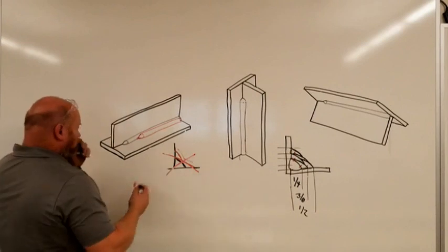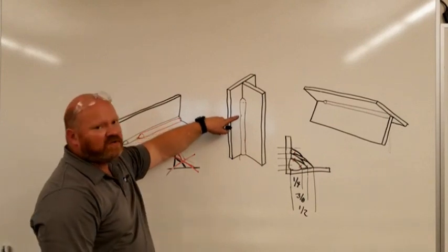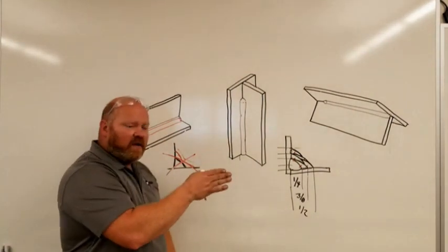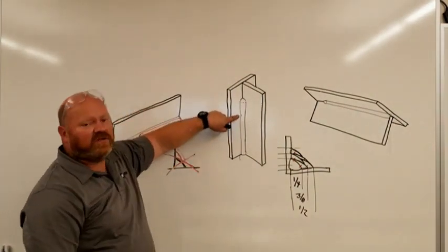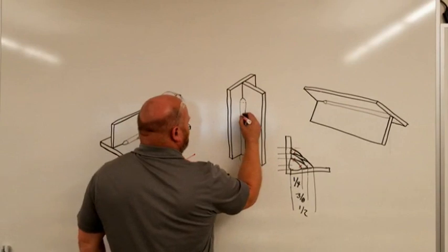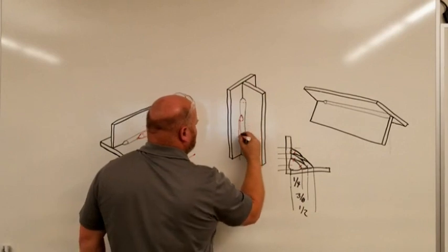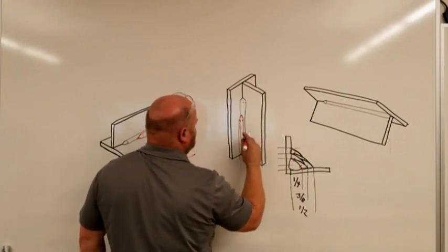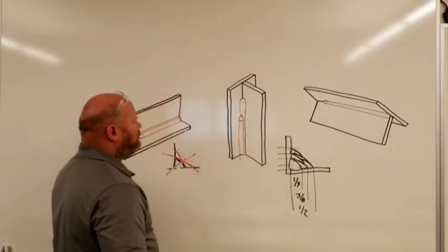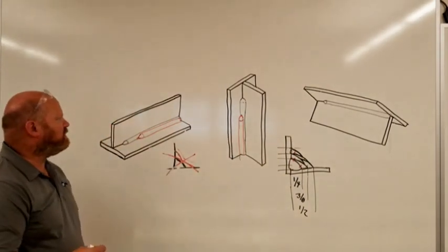On vertical, same thing. I'm not going to run my bead out on that toe. The wire might snug up against the left edge of the toe but I don't want to cross it, or I'll end up with too much weld pushed out to one side. That weld needs to cover 80% or maybe a little more of the previous pass. On overhead, same deal — your angles change slightly as they do in all positions, but the amount of weld I cover doesn't change much. Covering roughly 75 to 80 percent of the previous pass with almost every other pass.